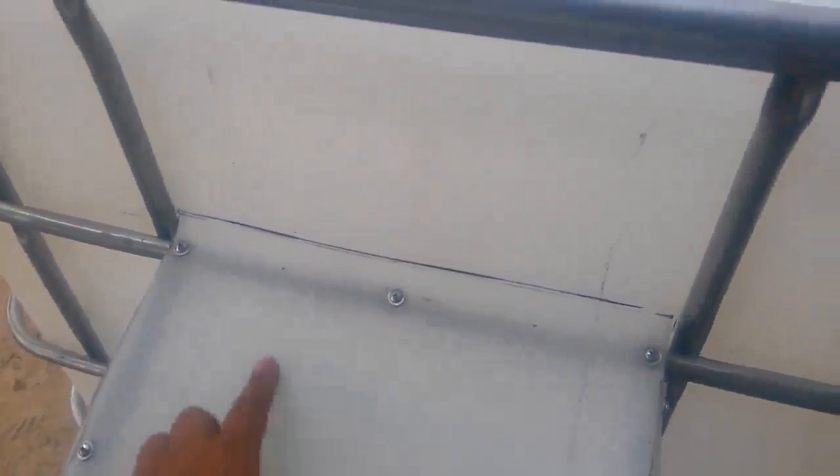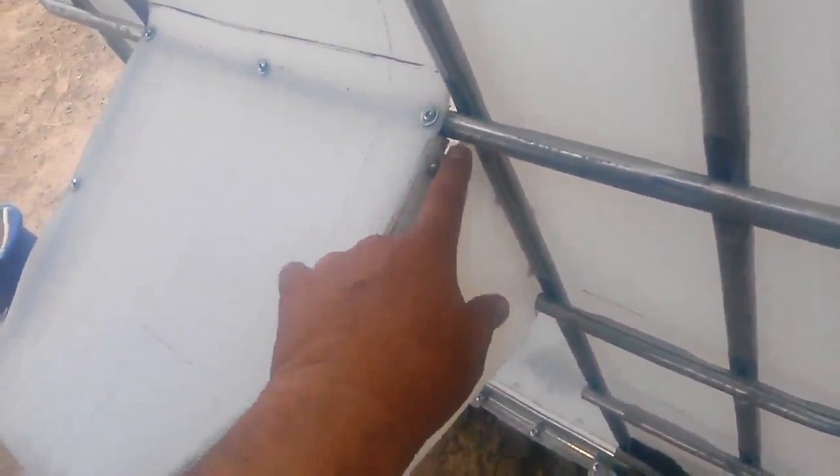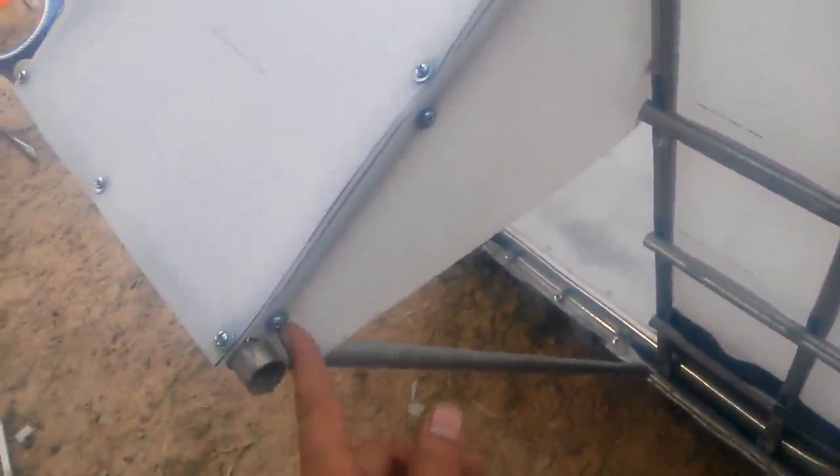You'll notice that I haven't cut it all the way — it's still continuous here. What I did was I just marked and cut out a slot to score it so that it's easier to bend. Then after I put it back in, this piece comes through here and sets on this bar. Then I took some half-inch EMT and cut some tabs out of it — a long tab around it so it's a continuous piece — and then put a tab on the bottom where it's screwed in.